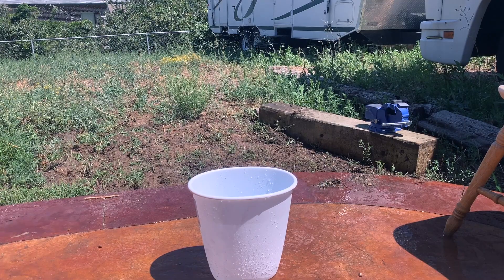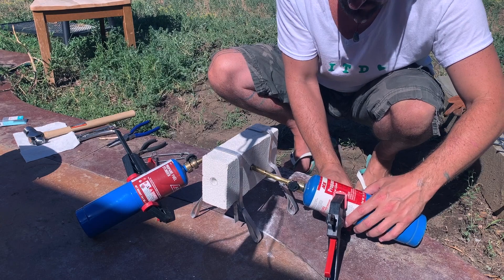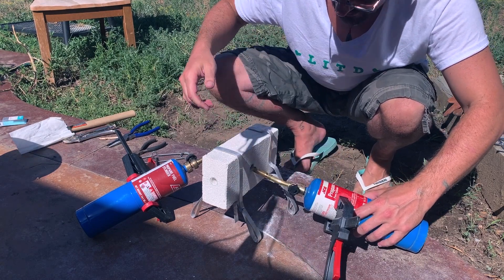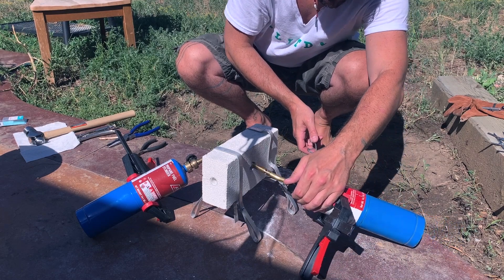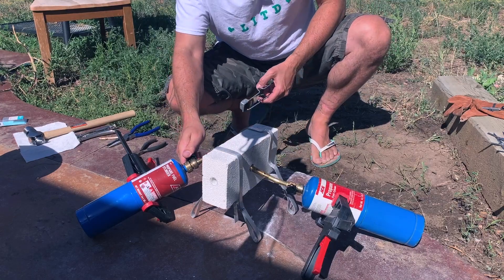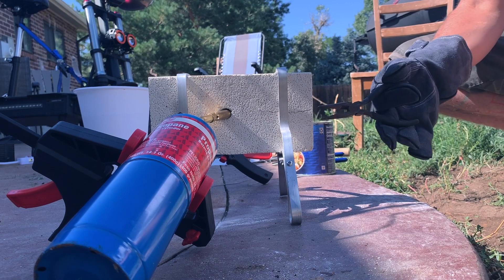Throughout the forging process when it is lit, I keep the hose running and I'll keep a bucket of water nearby. Be real careful about not putting water on really hot objects like the forge itself — because it's so hot it's going to have an explosion of steam if you pour water on there. That's just for emergency if a fire did get out of control.